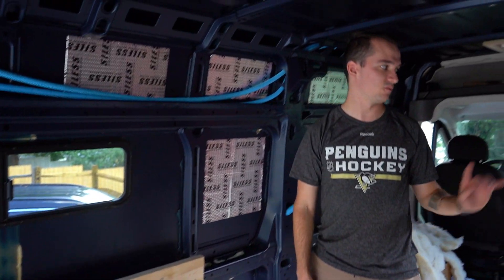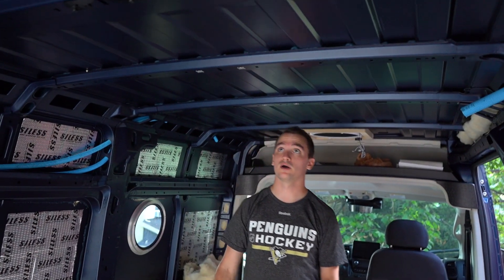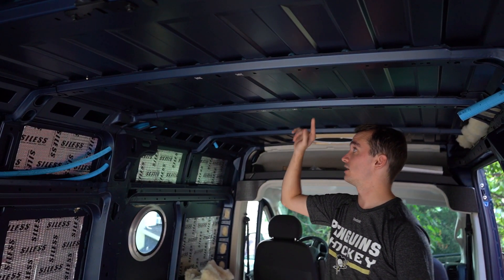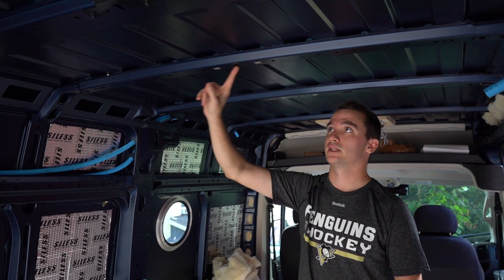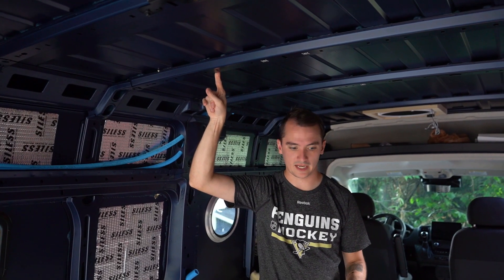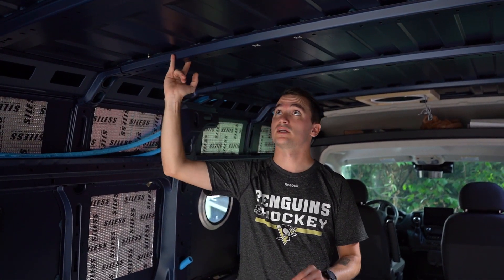While she's building the box, I'm going to start working on building four horizontal beams for the ceiling that will go across these beams and get screwed into them. I'm cutting three quarter inch plywood to go across here.